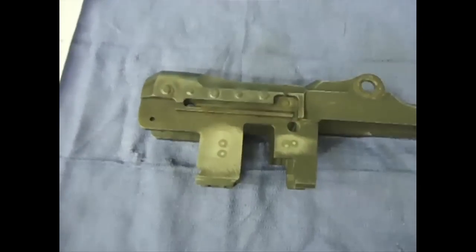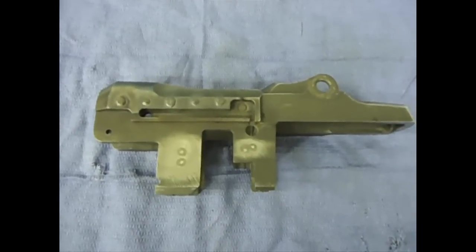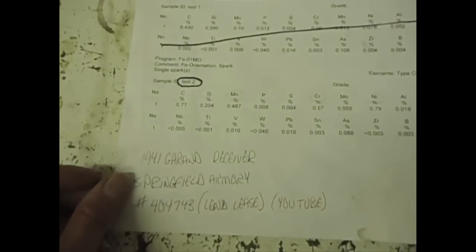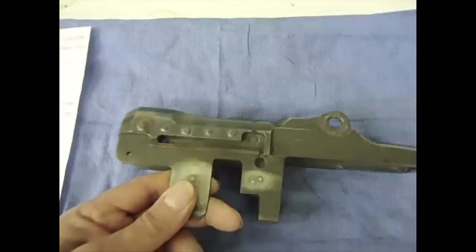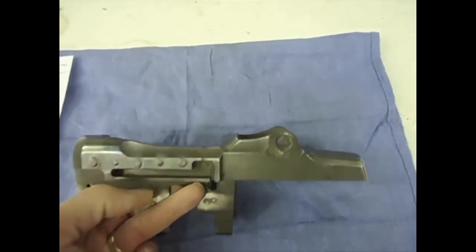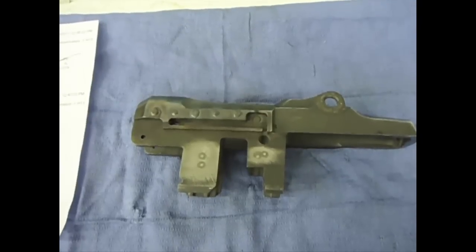Once I get that done, the rest of the receiver is quite nice. Then I'll send it back in and get it reheat treated back up to the same hardness. Most of these that we've been doing on these Garands, the Rockwell's between about 59 and 65 - that's actually what the specs call for. Now we've got our metallurgy test, we've got everything we need. So I'm going to take this in, get it annealed, and then I'll start filing it and repairing it. And then I'll keep you abreast of how I make out. We're coming right along - it's one more step in the process.